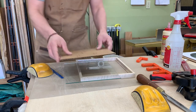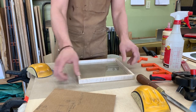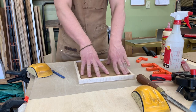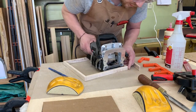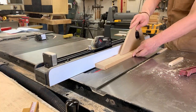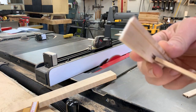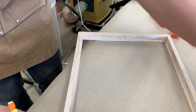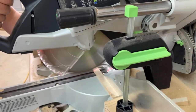I came back the next day and cut out my piece of cardboard — usually I use something nicer like foam board, but this is just for a personal piece — and made sure everything had a nice fit. To hold everything in, I use some simple friction stretcher pieces (no idea what they'd actually be called). I cut four slots with the biscuit joiner, then made strips of wood at the same depth as the biscuit blade, and cut them down to length about one sixteenth to one eighth over the edge on the miter saw.